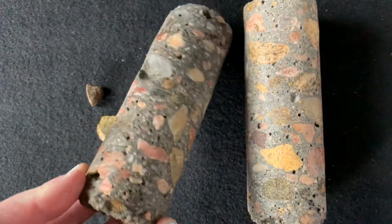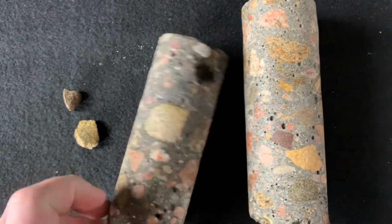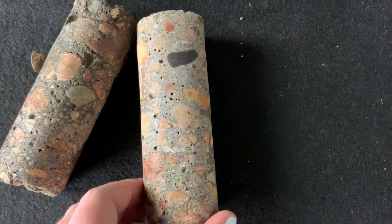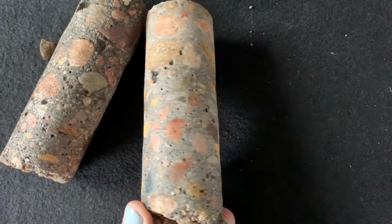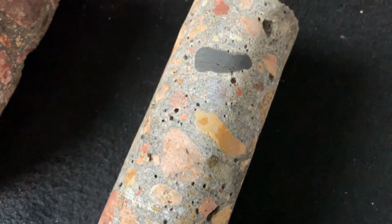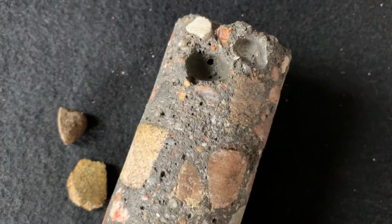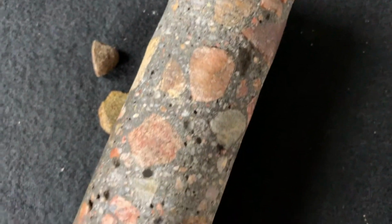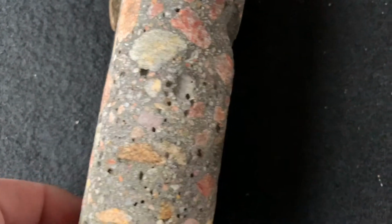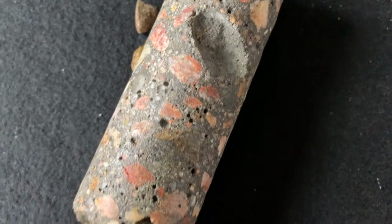And especially in that top surface, where that colder temperature really had its greatest impact, we can see that this is a concrete that, if it got any abrasion resistance or mag chlorides within its first season, would surely just fall apart. And this is where the lawsuits start, when a homeowner is rightfully in their place to complain about a product that would come from something like this, or a driveway that would come from something like this, and would want it replaced.